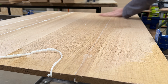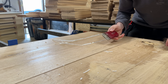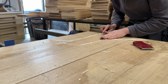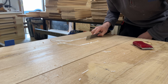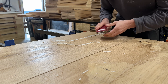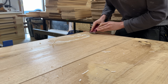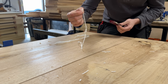This gold scraper has scraped every bit of glue off every board I've glued together in its life and it's never been sharpened or replaced. The theory of using the scraper is to prevent any possible chance of damage. If you come in with a chisel to slice these glue lines off, it's really easy for that edge to catch into the wood and if it's a brittle bit of wood it starts peeling — and if you're going to sand that to a finish, that's a real problem you'll have to fill or sand out. The scraper gives you an absolute guarantee you're just pushing the glue off the surface and actually advancing the finish to a better level than you started with. Plus it's really quick and it doesn't gum your chisels up with glue.